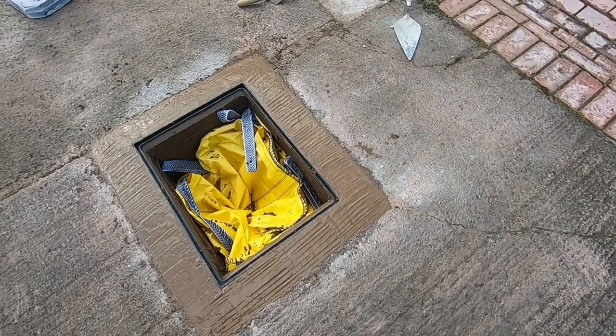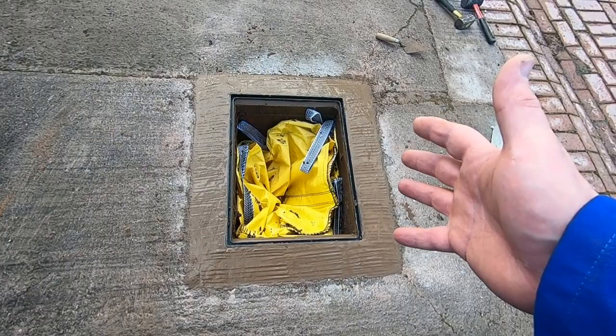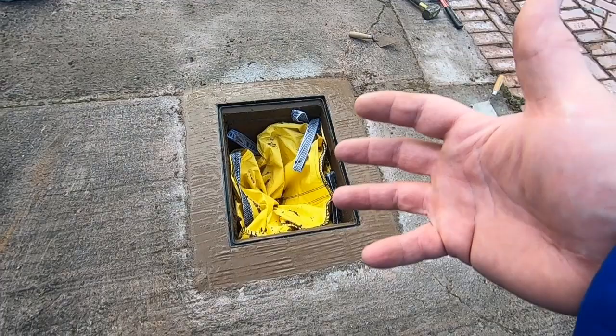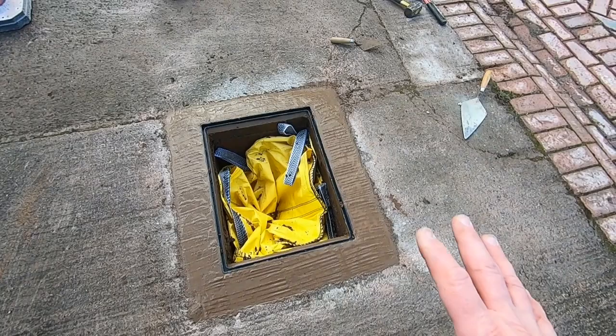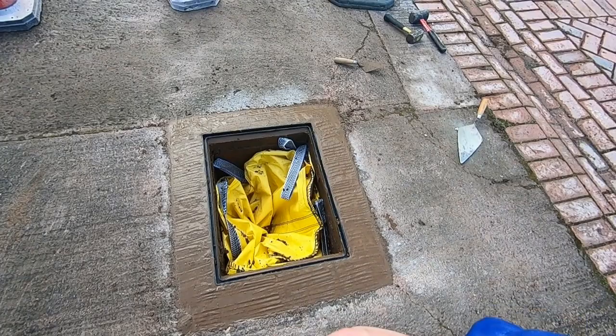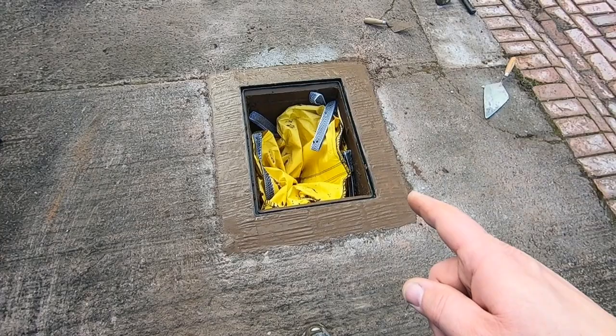Here it is — all I've done is put a bit of texture by tapping around the edges. It's not perfect but it's good enough for what it is. I'm going to leave this for a couple of days just because it's pretty cold here and I don't want it to move. The materials I used were about a shovel full of cement, a bag of ballast, and probably two shovels of sand. For a small project like this, don't be scared to go to a builders' merchant and get ready-mixed cement, mortar, or concrete — a lot easier, mix it in a bucket, off you go. Job anybody can do. And if you hire tools like the big grinder, make sure you do get your PPE — goggles, visors, earplugs — it is worth it.